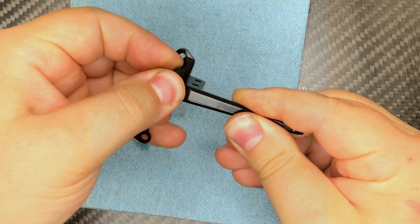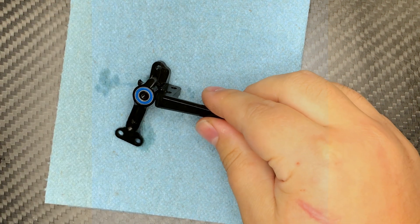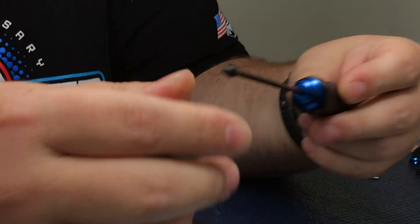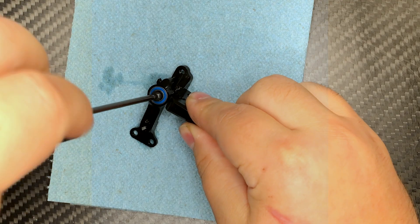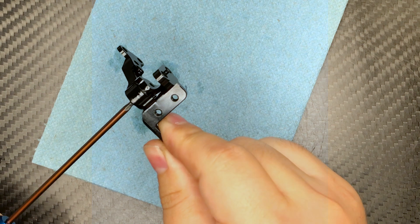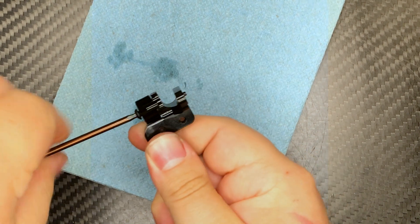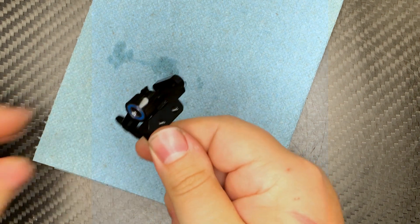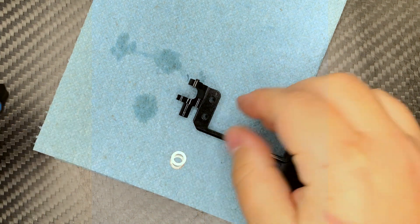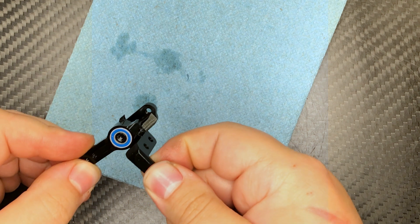Take the bell crank mount, and the last thing you're going to need is an M3 by 6 button head for this assembly. Screw this down — because we put those extra shims in the back, you're going to slowly tighten this and you'll feel it pressing on the bearings. Crank that down a little bit, then loosen it back up and now your bearing should be pressed in all the way. From there, take out these shims — typically you only need either 0 or 0.1 shims for this assembly to not rock back and forth.